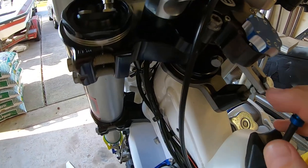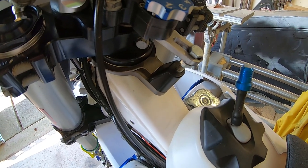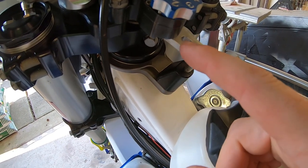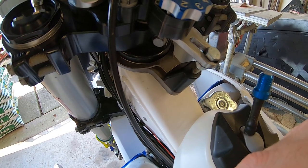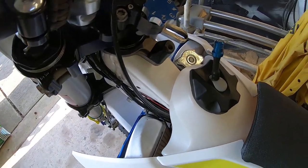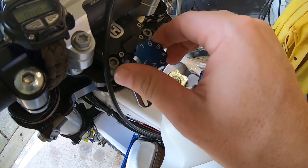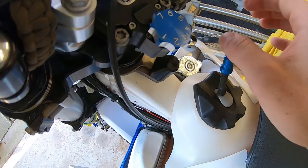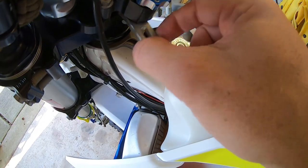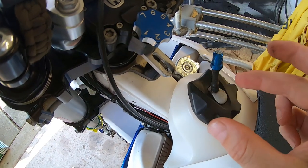As you can see, it's an under-bar mount. This screw is actually supposed to be a press-fit pin, but I noticed it was binding up and then noticed oil leaking here on the swing arm. The resistance setting is on the highest — number seven — and there's absolutely no dampening or stabilizing effect whatsoever. I'm going to remove these two bolts and hopefully the unit will slide out of the mount.